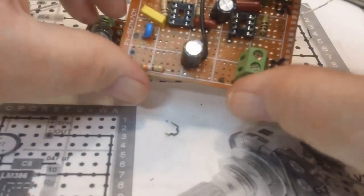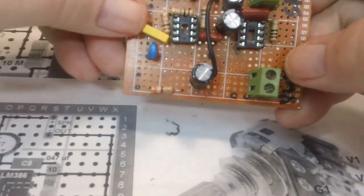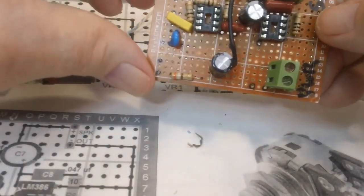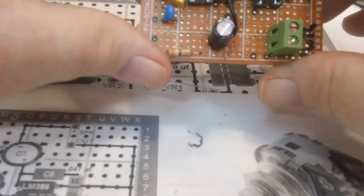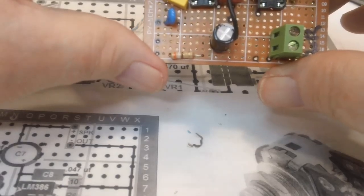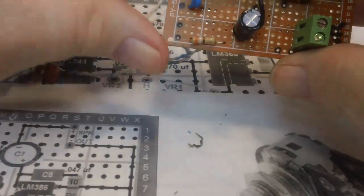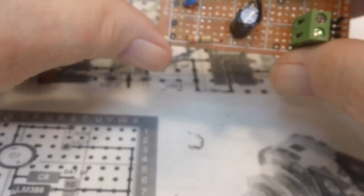Yeah, I've been at this for a while. And this is pretty much it as far as the board is done. So when I wire this in, the only thing left to do will be to put the switch in. And that is not really that difficult. It may look difficult, but it's not. You got two wires go here, and there will be a bridge on the switch to bridge the power from one side to the other. So either way that you switch it up or down is going to be power. Just the middle position will be off. And then the other switch is for the gain over here. Those two spots right there, and there's just two of those used. When it's switched up, it'll be in high, and when it's switched down, it'll be in low, and that's pretty easy to remember, I think.